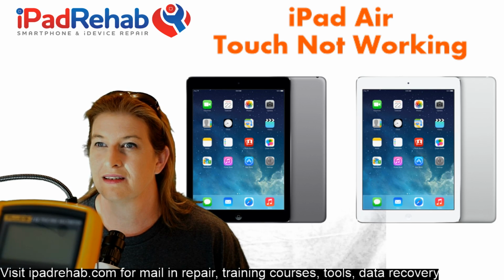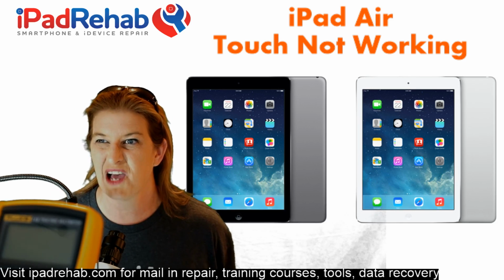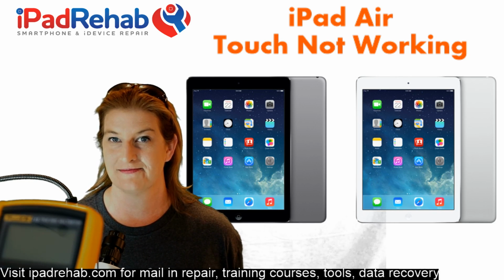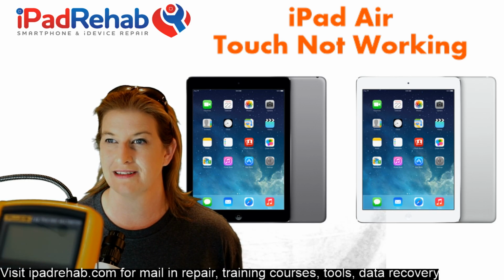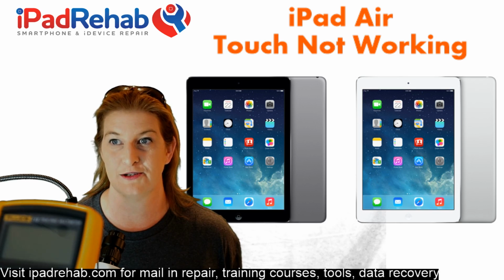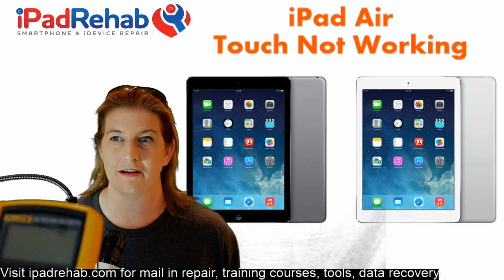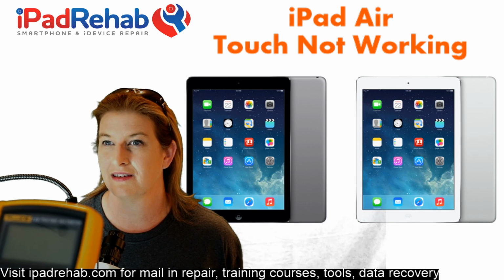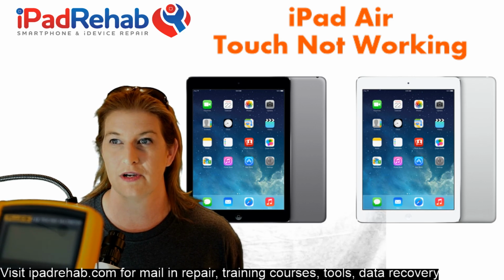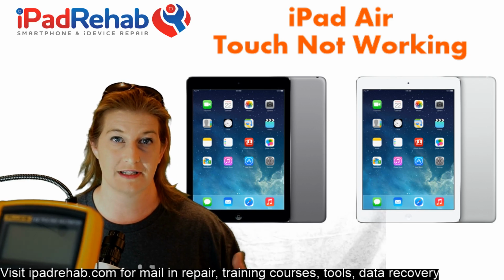Let's see. Here we got an idea. Give power to U6500. Well, it already has power at this line, and check if it works. Well, let's think a little bit harder if that makes the most sense right now. Okay, what if you inject 1.8 volts at the chip? All right, let's clarify what at the chip means. Are you thinking it's a broken trace or the voltage being pulled down to ground by a bad cap? Yes, it's either one.